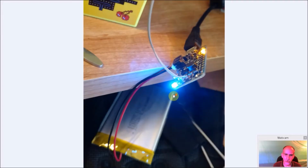And just another close-up shot of the power circuit itself. You can see here, you couldn't put a USB header on here, but I simply soldered right onto the pins. This just means that the unit is on and powered. This means it's charging the battery at a certain time. And you could pull ground from over here directly to the battery. You can bring another battery in instead of going through this connector. You can pump your battery on this side if you want to hardwire it.